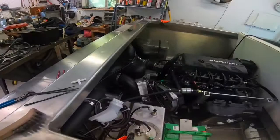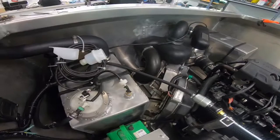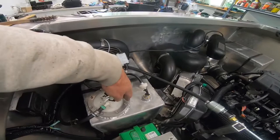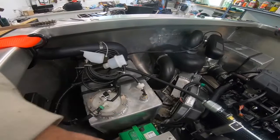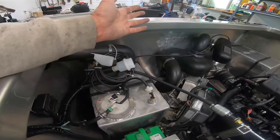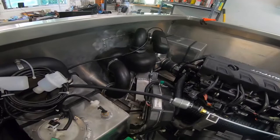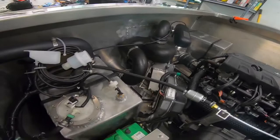For now I just needed to vent both tanks so they could equalize. If I open up this fuel line to let the fuel equalize with that tank, it's got to bring air into this tank and take air out of that tank so they can equalize. You can have them both open to do that, or just hook them together — the air is going to transfer as the fuel transfers on the bottom. That's how dual tanks work; you need that system fully set up.